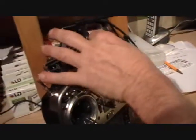But if you leave these values as is and you hit this ignore RPM, then when you move your sticks and you get your collective pitch high enough and your nacelle angle high enough, then the gear will automatically retract. And then of course when you decrease both of them, your gear will automatically extend. And when you're done testing that and you feel like you've got them where you want them, you can turn off your test mode and save to device, and this information will be saved to the device. So that's basically all you need to know: you can do it in manual mode with the aux switch, or you can do it in automatic mode, and that really reduces one thing you have to deal with. Okay, right.